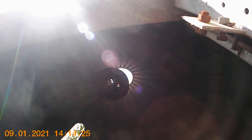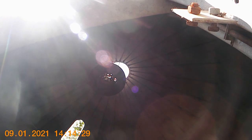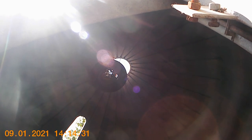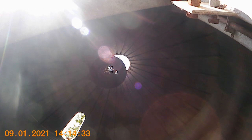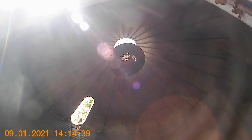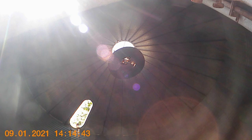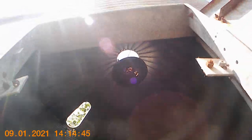You barely see it, but we got a crowbar spanning across the top of that hole. We just rigged a secondary chain to the tire and the wheel. It's going to support off of that crowbar across the top of the hole. About to let the slack off now from our chain on the wall. Slack's off, tire's chain, tire's holding. So we got that suspended.